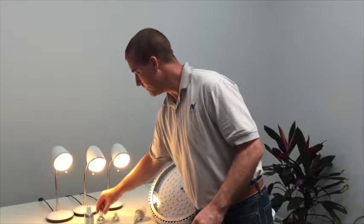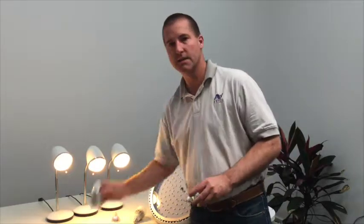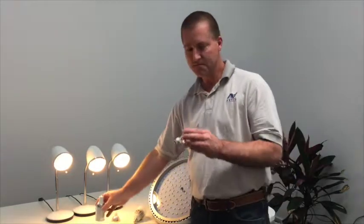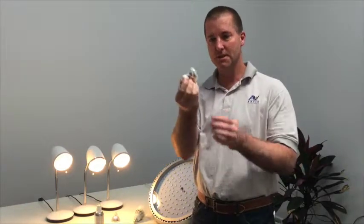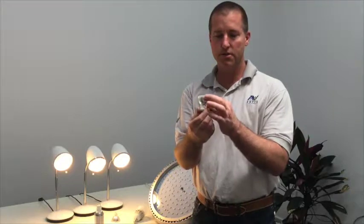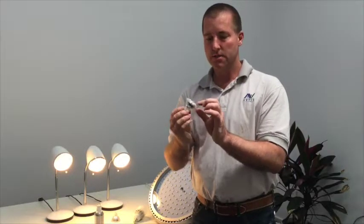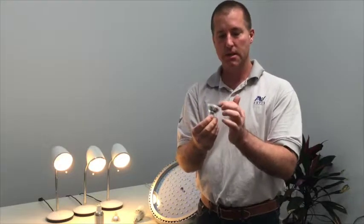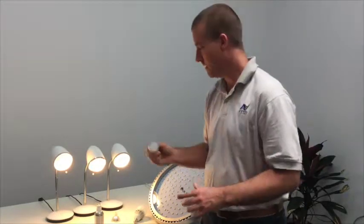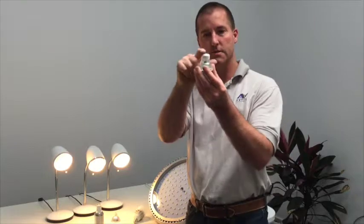Some other people thought, well, that's really great, but that one there doesn't fit in all my downlight fittings. And they developed another one like this. Looks like the glass ones that you're used to seeing. It's got nice glass surround working as a heatsink. It's got more LED chips on there than 3, so there's less energy per chip. This one here is a 240 volt one, which is this little GU10 socket.